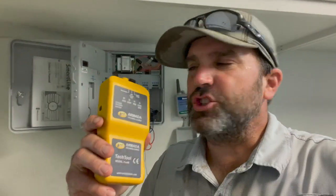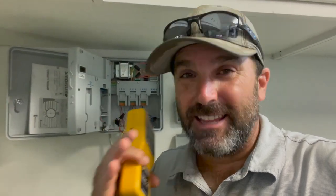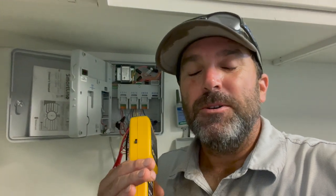In this video, I'm going to show you how to use one of these Armada Tech Tools in order to find a valve out in the yard. Now, typically, I'm going to use my valve locator, but unfortunately, I don't have it today because I let a guy borrow it. That kind of stinks for me right now, but it's a good thing to have some other tools. I've got this Armada Tech Tool, and you can chatter a zone, chatter a solenoid, and actually find it and hear it out in the yard.